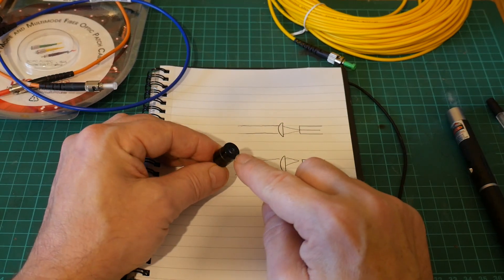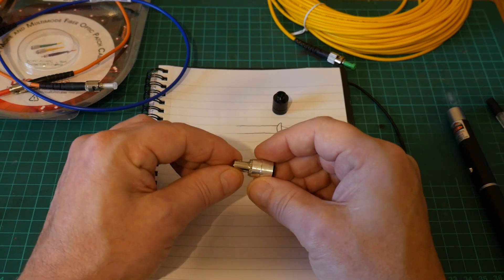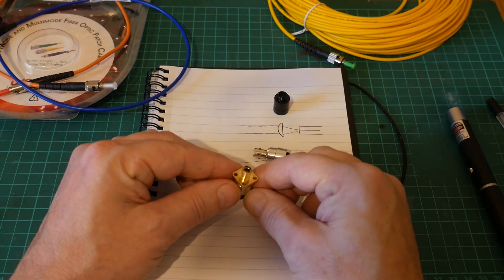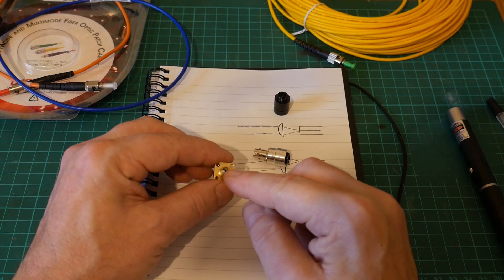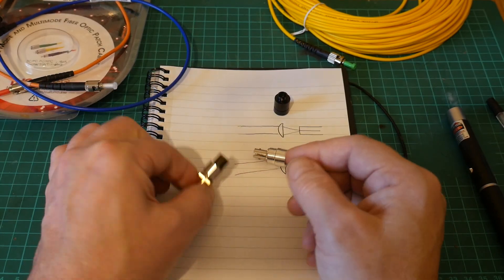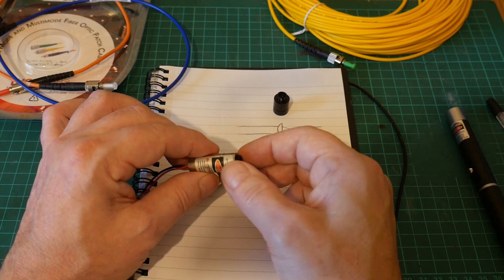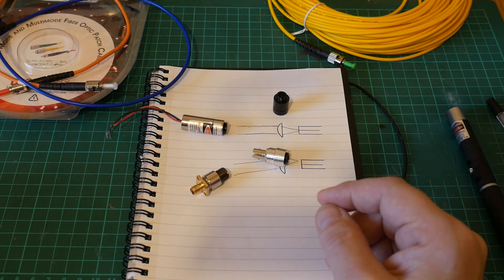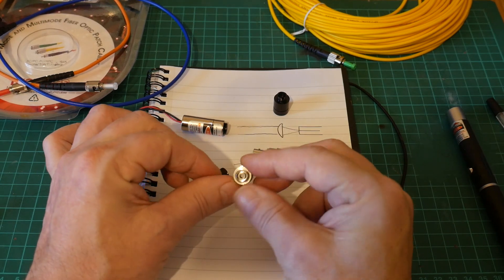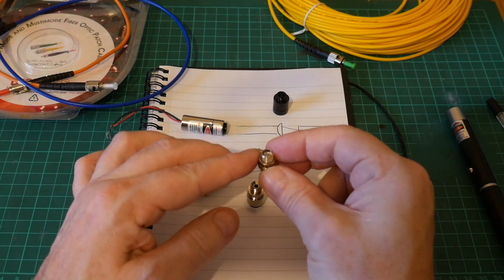Since I have such a variety of fiber connectors, I've made a bunch of my own. Here's one for ST connectors and another one for the SMA 905 connector — that's just a standard SMA connector with the electrical pin punched out and a collimator assembly from a laser diode silver soldered on. These lens assemblies for inexpensive laser diodes can be had for like 10 in a bag for a couple of bucks. Here's another one that couples to FC cable — another homemade connector where I've used a standard FC coupler, turned one end off in the lathe, and then silver soldered my laser diode collimator onto the end of it. We've got effective means of focusing the light, we just need an effective means of directing the light in there absolutely square.